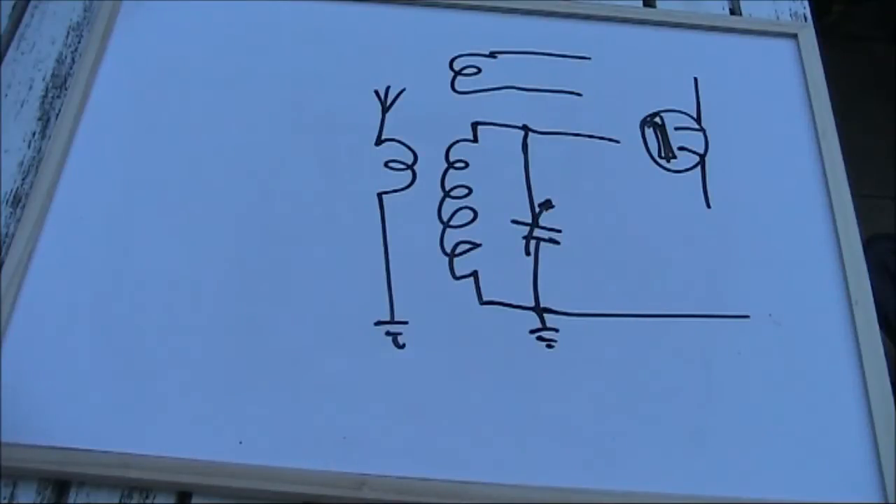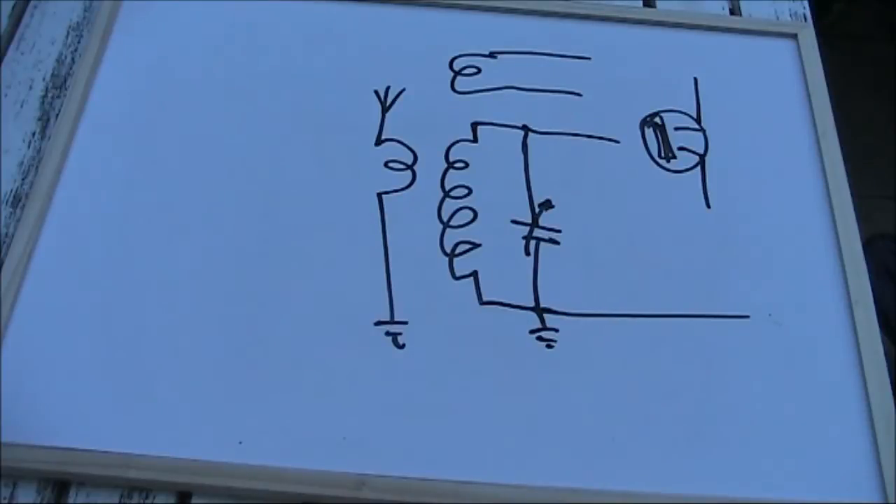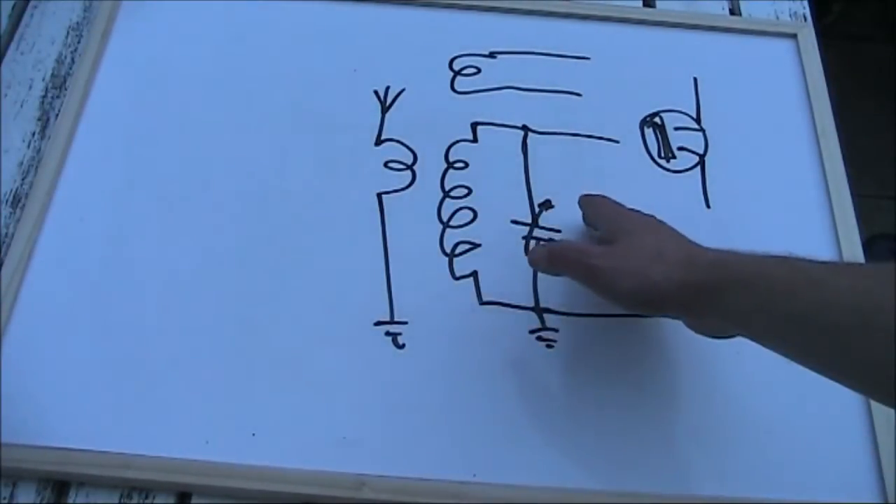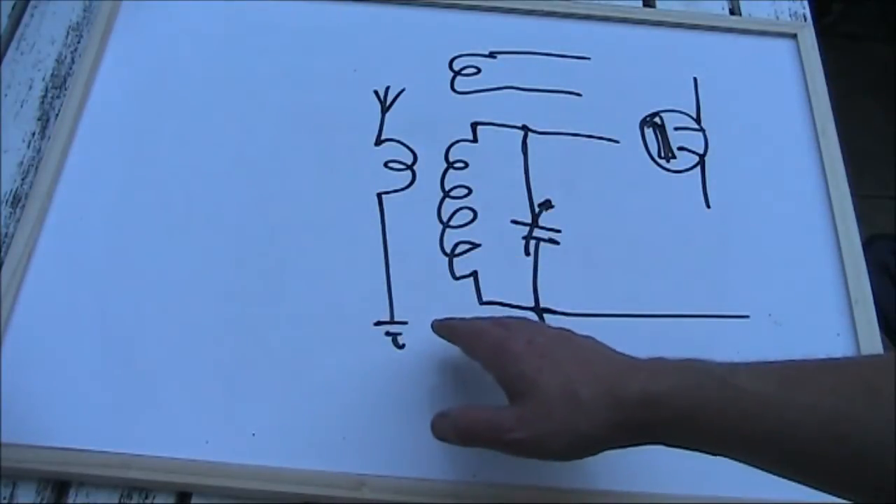Converting a regenerative set to a lower frequency is easy to do, and the performance should be at least as good as what you started with. When you're trying to convert to a higher frequency, all sorts of things arise that you might not have experienced at lower frequencies. That's especially if you're using the receiver to tune CW or SSB signals. Tapping on the receiver's case or putting your hand near the tuning capacitor or coil may cause the frequency to vary quite a bit.